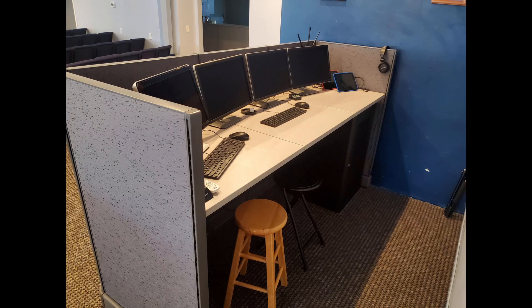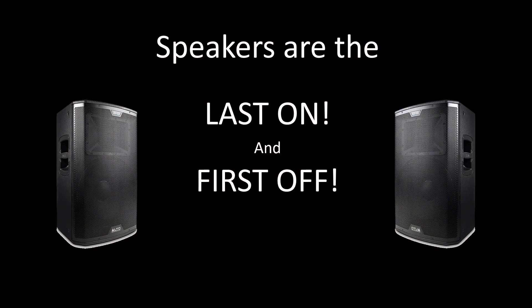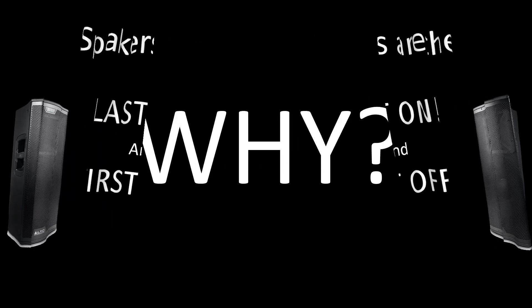Do you remember the statement made at the beginning of this video? If you only remember one thing after watching the entire video, it would be this: speakers are the last on and the first off. But why? You may think that just because you turn something on or off in the wrong order, nothing will explode — right? Well, something could. What could actually blow up is the speakers. When another device connects to or powers on, the speakers produce a pop sound, and the speaker might go into overdrive because of this quick pop — physically blowing out. To eliminate this pop danger, we power on the speakers last and power them down first. I think everyone enjoys blowing some stuff up occasionally. However, let's attempt to avoid that in our humble church building.